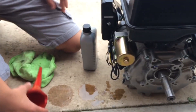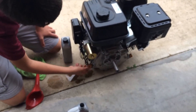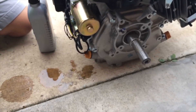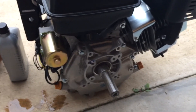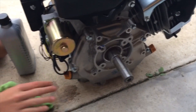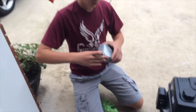The oil is in now. You want to check your oil level one more time once you've added your oil. These do have low oil cutoffs, which is another Honda thing — because these are Honda clones. There are two oil fillers; you can use whichever one you want. You shouldn't really have to worry about oil — it's just one quart and then a dab of another quart.